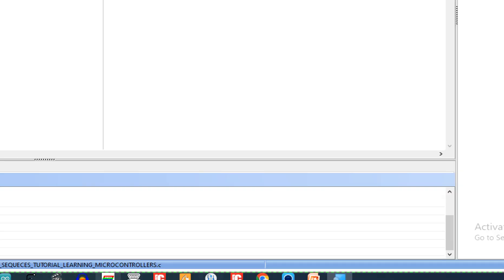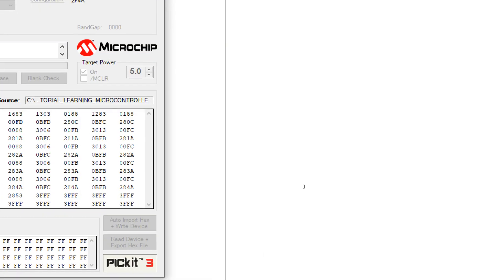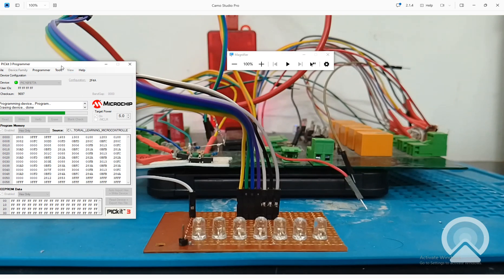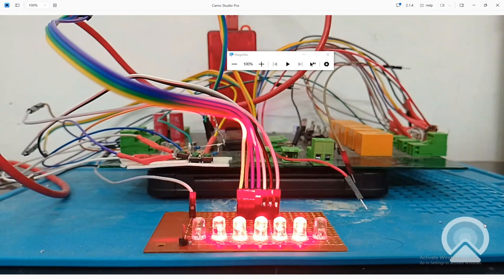The code is successfully built. Let me get to the PICkit 3 programming tool. Click on File, Import Hex File, 'LED Sequence Tutorial', then click on Write. The new code is being written. Let's get to the hardware to see what happens. The hardware is now burning. I power it up from the software — I click On. See, it is following our sequence — that's how we had programmed it.